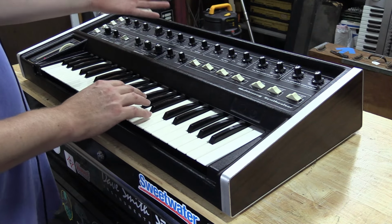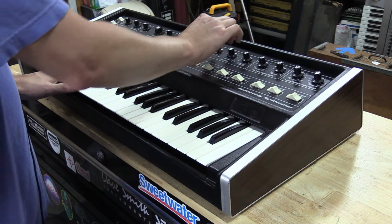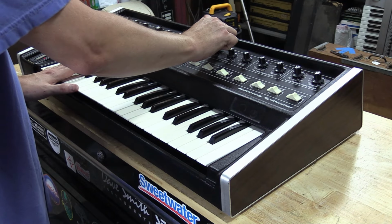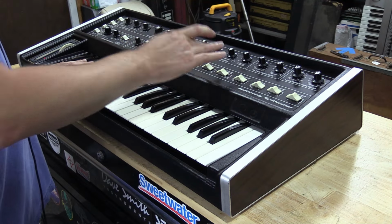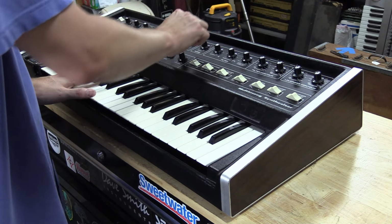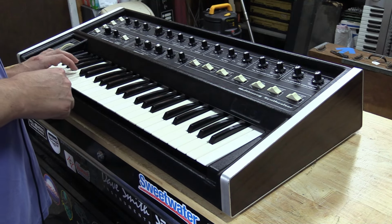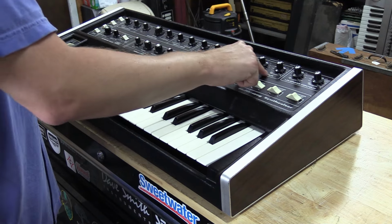So right now we're in normal mode. We got the oscillators back on. So you're actually hearing the oscillators. So right now we're normal, we'll go to full. We still have emphasis control because it sets the resonance. Actually bring up the amount of contour here and just kind of put a little bit of contour on. I'll go over the contour here in a minute in more detail.